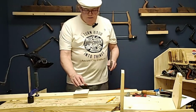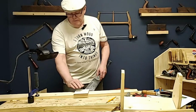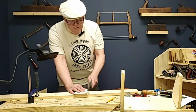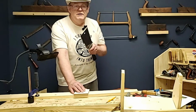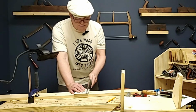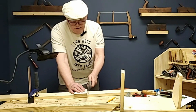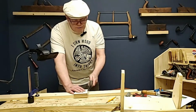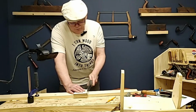All right. So we're going to use our saw guide that we have here. Okay. Make sure that's firmly up against there. Line it up. And then, again, light grip. And every time I say that, I'm really talking to myself because I know you've heard me say this at least a dozen times already. I just tend to grip this thing so hard and it knocks the thing out of alignment. Light grip, let the saw do the work. Keep the wood between the saw and your little one's fingers, and just back and forth.